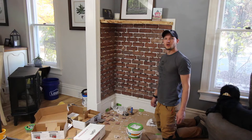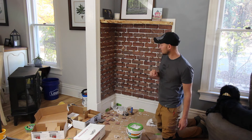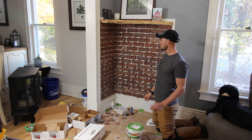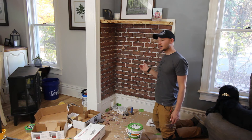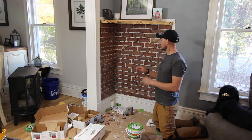We have all the brick up and everything's spaced. I ran out of spacers so I cut some plywood, which happened to be the same width, and those worked out pretty good. Towards the top I had to reduce the spacing a little to get the last two bricks in, but it came out really good. This mortar takes between 24 and 72 hours to fully cure and dry depending on humidity and temperature. Here in Colorado we have pretty low humidity, so I'm going to put a fan on it and it should dry pretty quick. If the brick can still move in the morning it's not fully cured; if it's really stiff and the mortar is hard, then we know it's good.